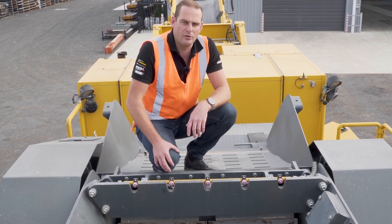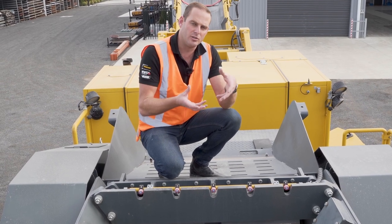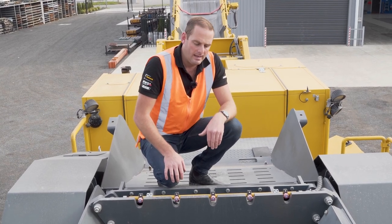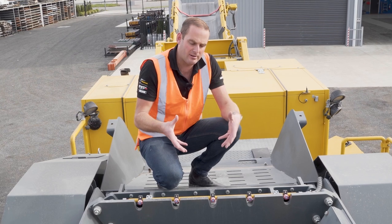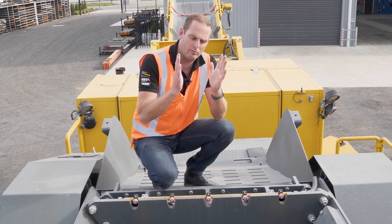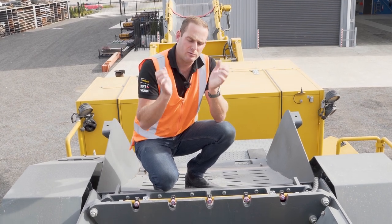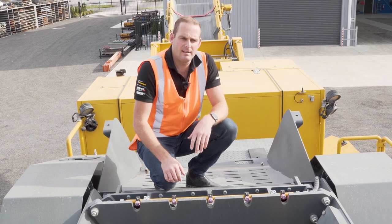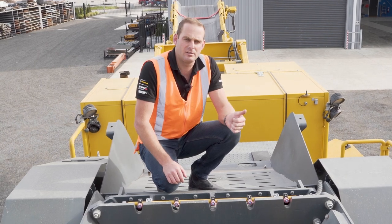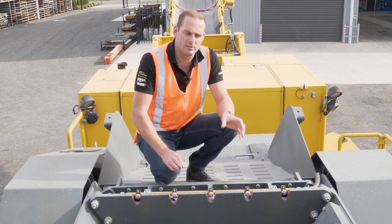These jaws are called a Keystrak non-stop jaw system. The way that works is there are a couple of big cylinders behind the jaw that enable us to adjust the closed side setting on the fly. In the case that a piece of steel — like a track roller — goes into the chamber, it'll sense that pressure and open up in three increments. If that object is too big, it'll close down the whole jaw. This means you don't damage a toggle plate, so with a Keystrak you should never need to replace the toggle plate from breakage. It's got its onboard safety system.